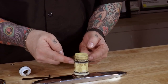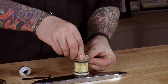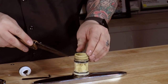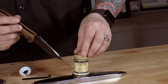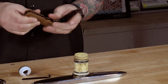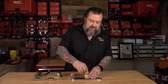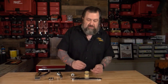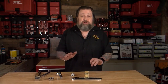These two O-rings right here are your offending pieces. You're going to pop these off and put the new ones in out of your kit. If you've got a little knife or something like that, you can get underneath them and get these loosened up. You can even cut them because you're going to throw them away anyway. There are also two little seats and springs on the inside — once those come off, put the new ones on and reassemble. Those seats come out of the inside, and then you're going to have a brand new working faucet when it's all said and done.